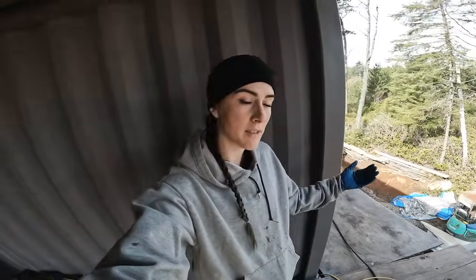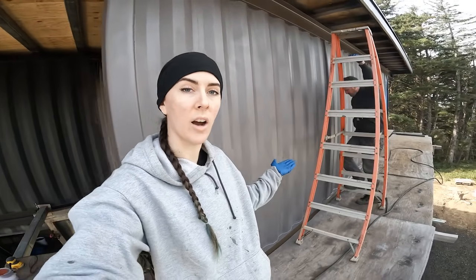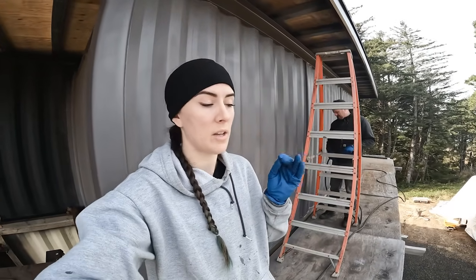All right, here we are up on the scaffold. So it's been some time since we painted our entrance structure with the epoxy primer. And now we are going to go over it with the black top coat that we've used for the whole house. We are gonna use the airless spray gun to paint this whole side and this side over here.